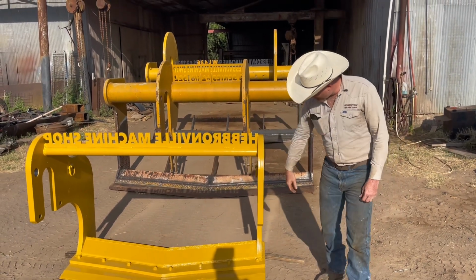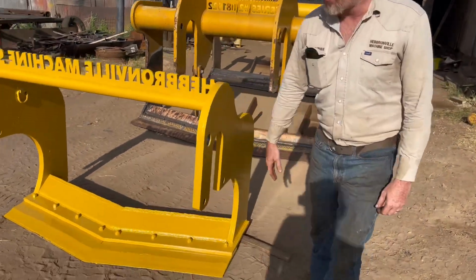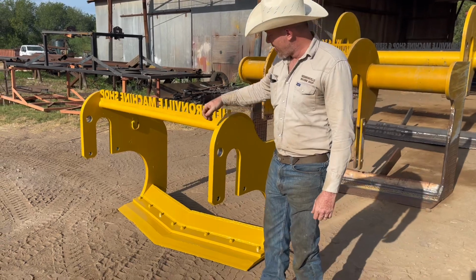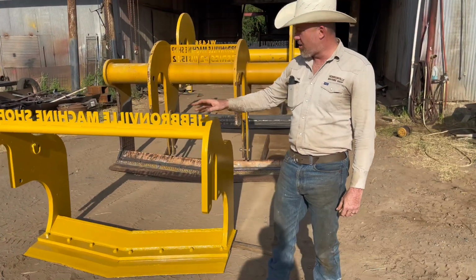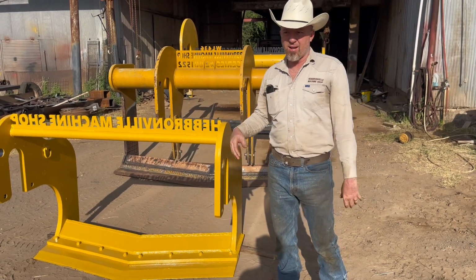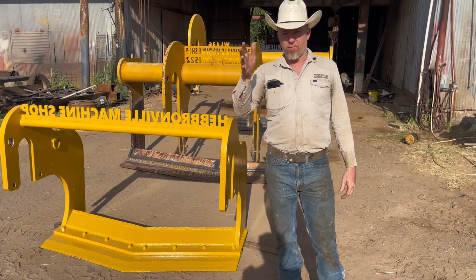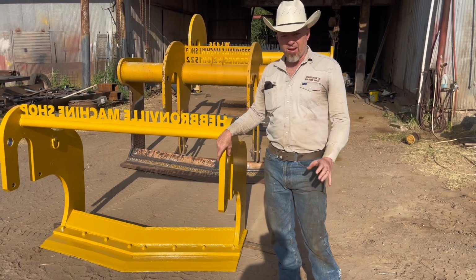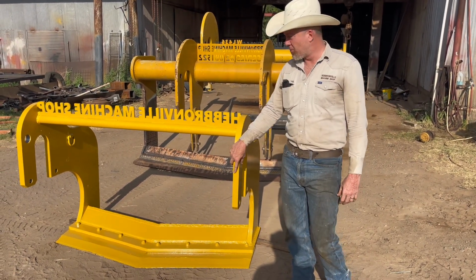We do put all of our standards, or whatever you want to call them, but we call them standards, on the outside of the plow. There's no plow sticking out past our uprights or standards, and that keeps anything from obstructing the flow of dirt and brush through the plow. There's nothing worse than being clogged up all the time and having to back up and waste your time. You make your money going forward, not backwards. While you always do have to stop and clean them out every now and then, it's very rare with our plows, and that's what we designed them for.